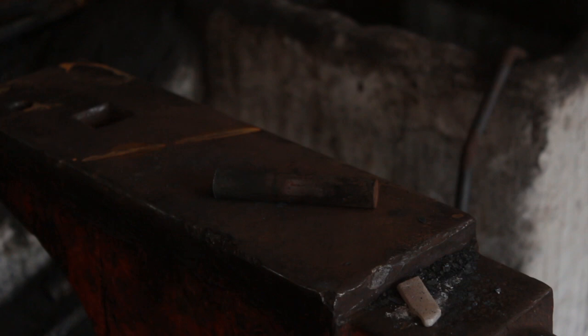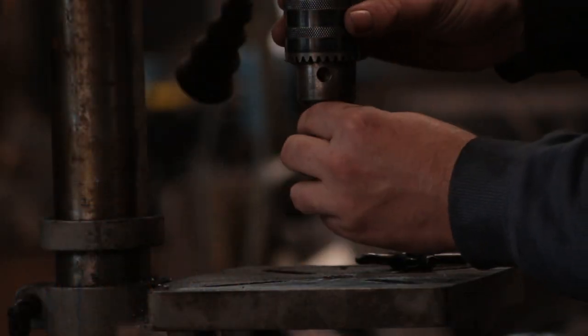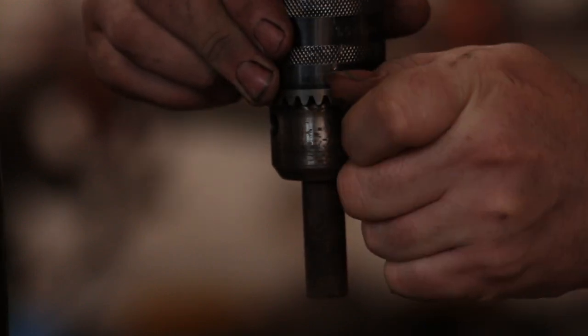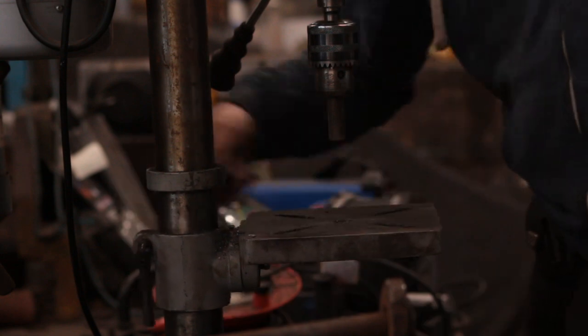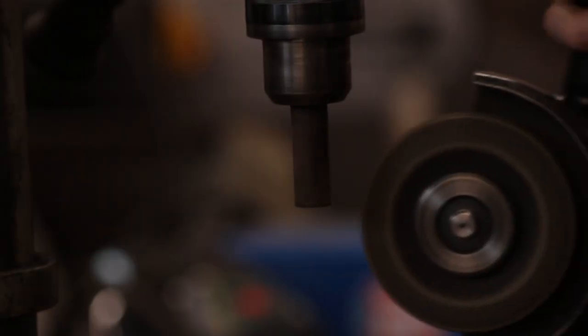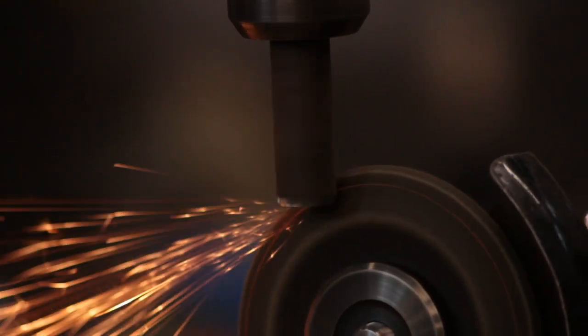For the acorn template I'm using a piece of 16mm round, just a short length. I'm going to use a technique I got from another blacksmith, which is to use the pillar drill because I don't actually own a lathe. Stick the 16mm in there, make sure you tighten all three points. This is a technique whereby you use your pillar drill and an angle grinder with a grinding disc and just start shaping an acorn.